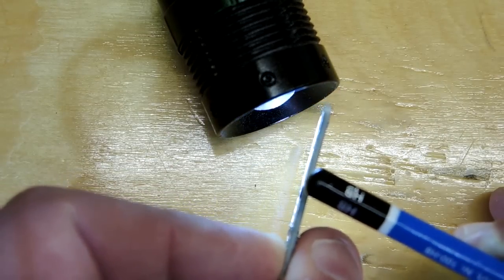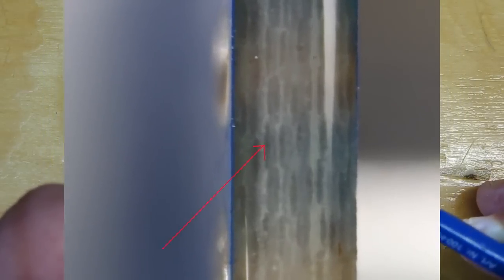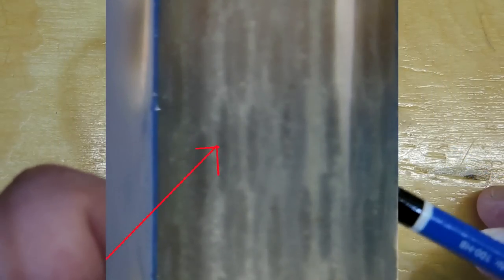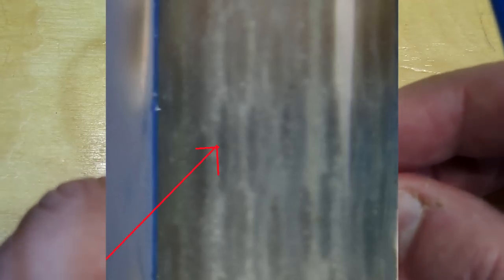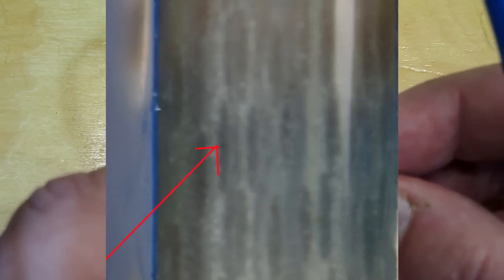Taking a look at the photograph just before grinding, you can see the actual fibers of the construction of the circuit board. Let me grind off a corner of it. This is fiberglass, so you grind it with an underwater-type slurry so you don't release a lot of fiberglass fibers into your environment — probably not too healthy.